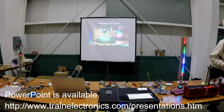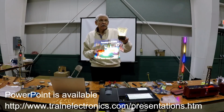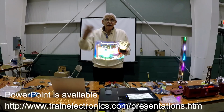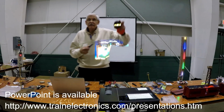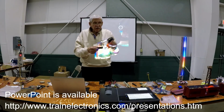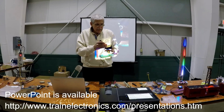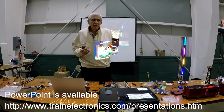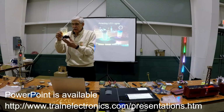But I wanted to kind of bring together the laser cutter and LEDs. Laser cut. How long did it take me to design that in CorelDRAW? Not very long, because I went into Google Images and searched for PRR and took an image off of that and traced it. But the real magic is this. You can buy these little bits. Can you see what's inside? Same stuff, right? This one comes with a remote control, so I can change the color, I can change the sequence, I can change the speed. This on Amazon is about 15 bucks. You can find them on eBay out of China for about 7. And if you have access to a laser cutter, all you do is make sure there's a tab at the bottom that goes down into there, and it lights up beautifully.